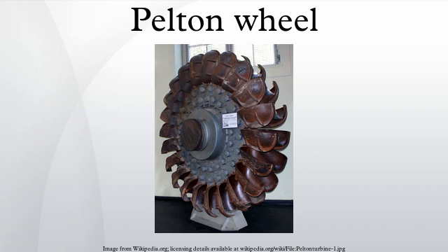Turbine physics and derivation — energy and initial jet velocity: In the ideal case, all of the hydraulic potential energy is converted into kinetic energy. Equating these two equations and solving for the initial jet velocity indicates that the theoretical jet velocity is v₁ = √(2gh). Assuming all velocity vectors are parallel, and defining the velocity of the wheel runner as u, then as the jet approaches the runner, the initial jet velocity relative to the runner is (v₁ − u). Due to conservation of mass, the mass entering the runner must equal the mass leaving the runner.